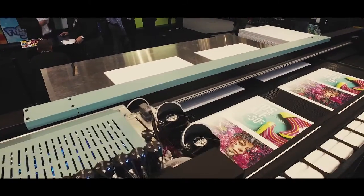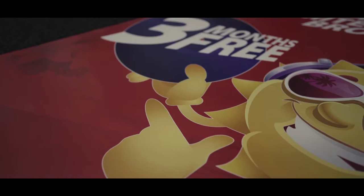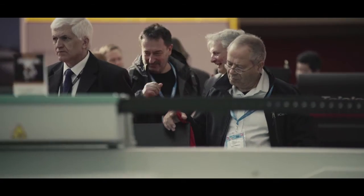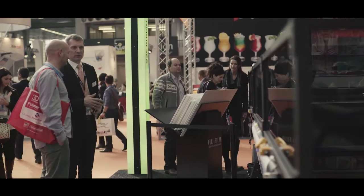Lastly, the blood of the printer — the ink, UVjet US. This is a brand new ink system specifically designed for a hybrid printer. With a hybrid printer we need both wide adhesion and flexibility, and this chemistry actually restricts the gamut slightly compared to what people expect from traditional Fujifilm UVjet inks. So we've added orange as standard on board the printer to both recover the gamut and increase it further, and people here on the stand have been extremely positive when they've seen the reds and some of the Pantone colours we've been printing.